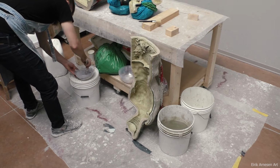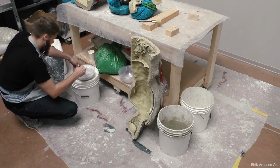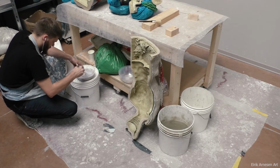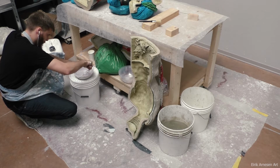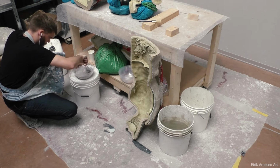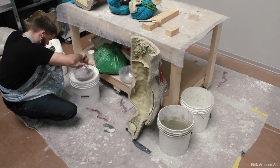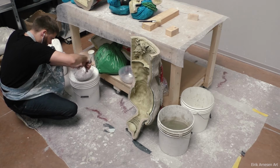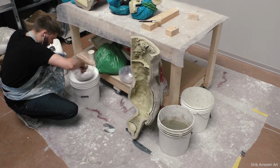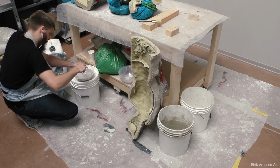The resin is very easy to mix. They recommend a 2:1 powder to liquid mix ratio, and it doesn't really matter if you add the powder into the liquid or whatever way you do it. It's very flexible in that manner. I prefer to add the powder, just like I do with plaster, just because it's easier to remember. Personally, I never really followed the 2:1 powder to liquid mix ratio that closely, and I just mix until the consistency is right for the job at hand.